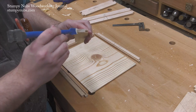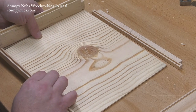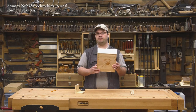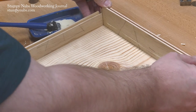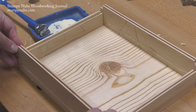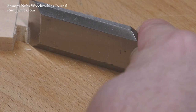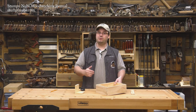To begin assembling the pieces, I only put glue on the dovetails — I don't glue the bottom panel into its slot. The panel slides deeply into the slot on one end of the box so I can get that final end strip on, then I use my fingers to work the panel back so that it's floating in all four slots around the perimeter. The rest of the assembly is easy — I build my box upward just like a log cabin. I dry assembled it first without glue, looking for gaps between the strips, and then used a chisel to fine tune the width of the dovetails, shaving just a tiny bit off their width to close up the gaps. Log cabins were built in much the same way — each log was put into place then removed for tuning, sometimes several times during the assembly process.